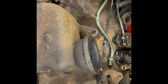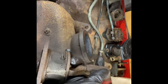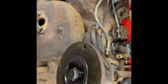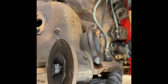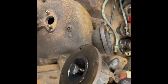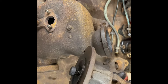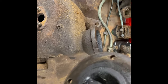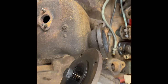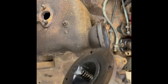Then the air intake valve is here. In the all the way up position, the spring on the bottom is at its tightest, so it holds it tight. That's effectively like putting the choke on. When I screw this out, a bit difficult one-handed, bear with me, that spring lengthens, as you can see there, and it takes pressure off that valve, so you can then open it up.